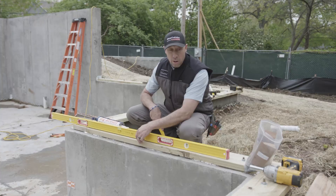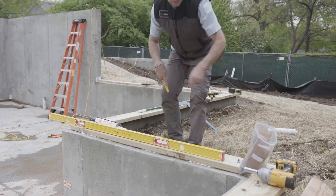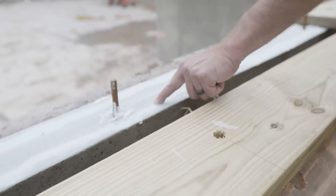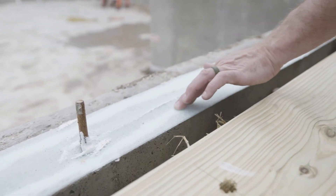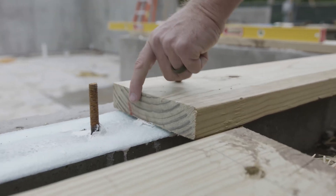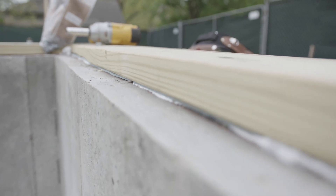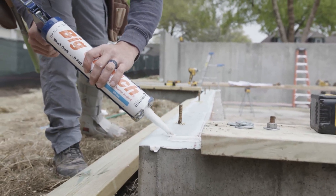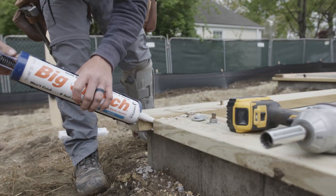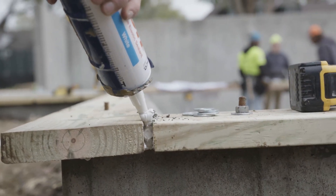One of the things that we like is what I call full moosh, where you can see the sealant squeezing out from underneath the gasket. You can actually see it in the foreground here as well — the continuity of the white line, at no point is there a gap. When they squish the board down, that mooshing action causes that sealant to spread and squeeze out on the inside. That gives us the ability from the inside of the wall to know that we have certain continuity of air barrier at that location. We will also use that continuous sealant approach in between the mud sill connections, because obviously we won't get boards that are all perfectly continuous — there are going to be joints. Every corner is going to have a joint, and every time we have a wood-to-wood interface at this level, we'll apply sealant there as well.